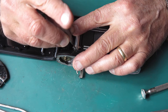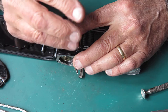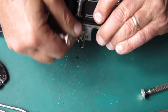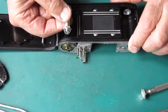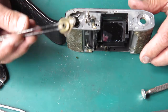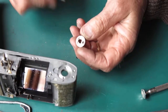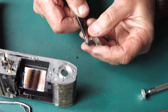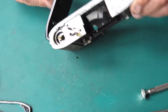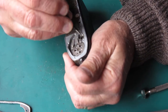Remove the screw from the top of the shaft here that drives the film sprocket. From the sprocket shaft: here's the sprocket, here's the guide bush for the film advance, and the clutch. I'll split the clutch — it's three components — back to the base of the camera. I'll unhook that spring.